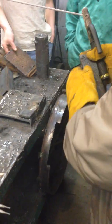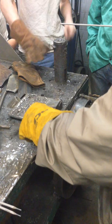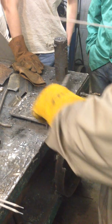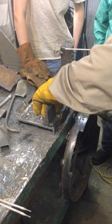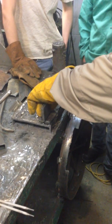Now, if you want to really be sure to get this straight, you take your marker or a piece of chalk and line it up where it's going to be sitting on the plate. Put your two lines there to show where you can set the plate up in the middle, and then you can tack it together. I'd advise you to tack it on each end first, and then check it and see if it's working.